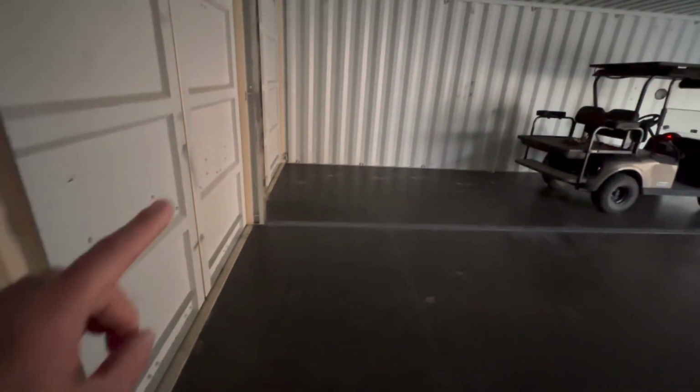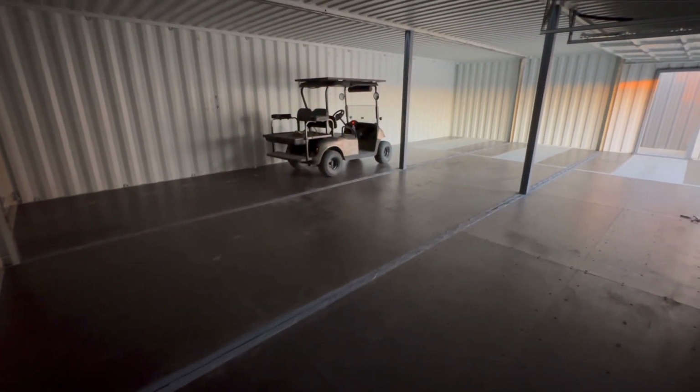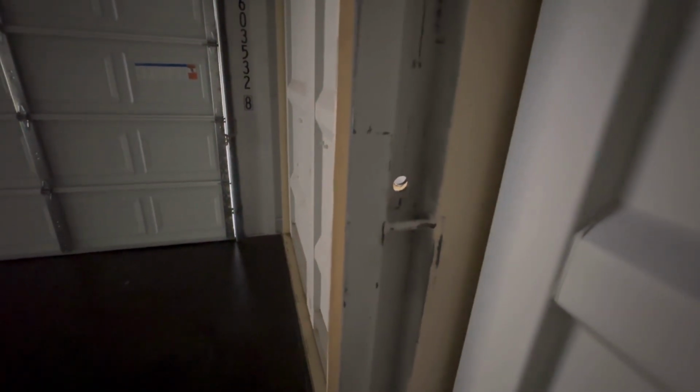So our tow truck drivers are going to pick up each container one at a time. They're going to go to the site where this is going, and then they'll have a Bobcat, and we have shipping container wheels that clip on here. And so they'll get all these moved into position, and once you get them close, you get your bolts in the holes, and you get a bolt about an inch longer than you need, and then you use grade 8 hardware. Can't use grade 5, they will break, we've tried it. With grade 8 hardware, you can cinch these containers the last inch just with the hardware. So that's kind of how we get them butted up on the very last step.